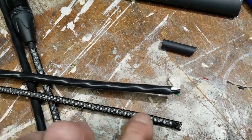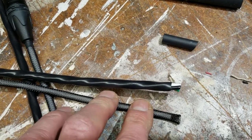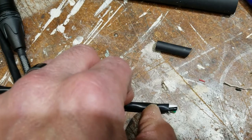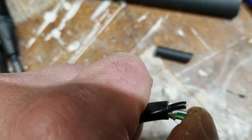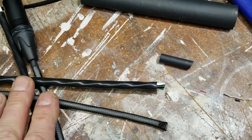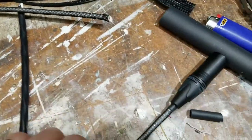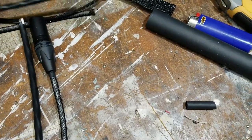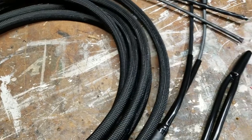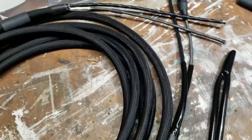When you wire in the electrical on both ends, you need to tie in that drain wire with your green ground. That will help diffuse any electrical radio frequency interference the cable is trying to emit instead of infecting your audio cable. I was quite impressed with the double shield on this cable — it had both a copper braid and a foil. So this is double shielded. Any RFI created through the outlet that goes through this cable gets blocked by the foil shield. So long as you have that drain wire tied into your green ground when it's plugged in, all of that RFI will get dumped to earth ground.